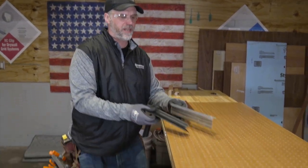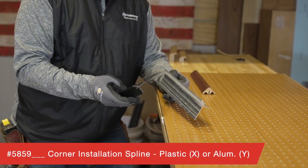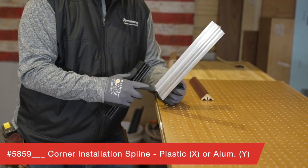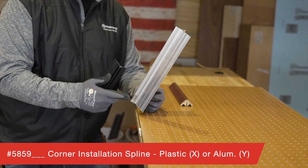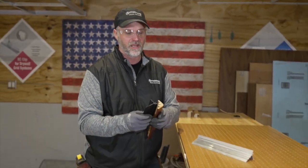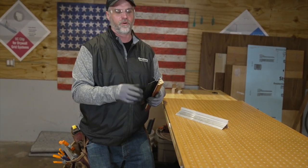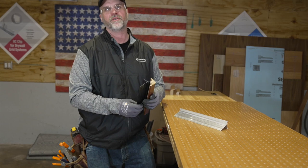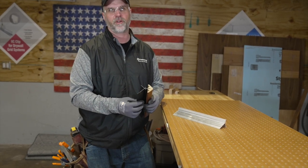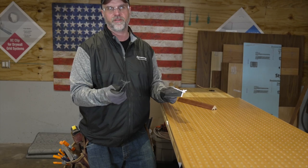We have outside corners in both aluminum and plastic. I recommend aluminum for heights up to eight feet; for anything taller, plastic works fine as well. The wood does lock onto the plastic more easily, but the main reason to avoid plastic on the lower eight feet is impact resistance — if you hit it with a cart, aluminum is much less likely to break than plastic.